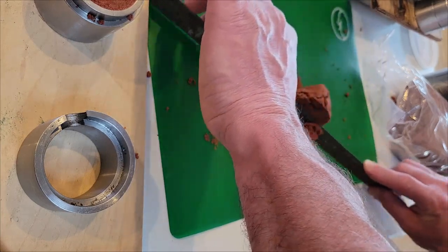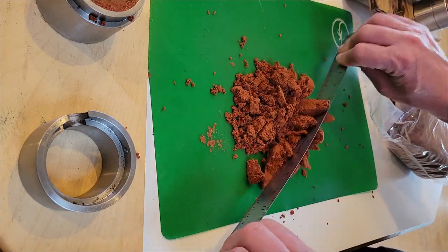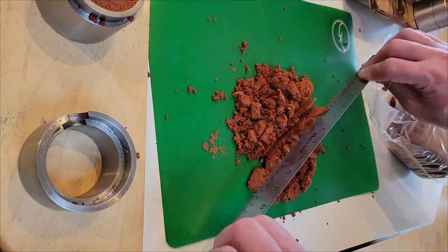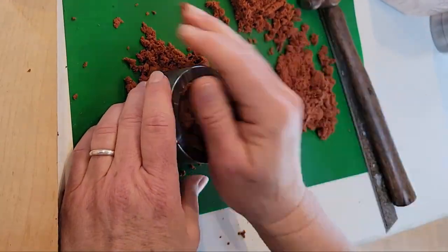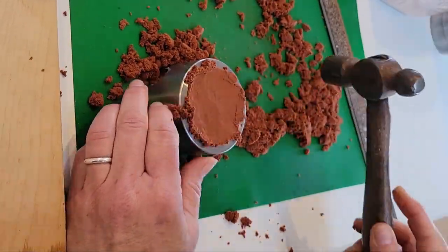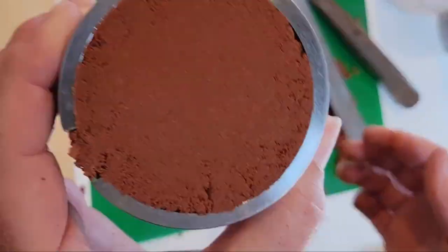My oh my, Karen, what impressively large hands you have. Steve jumped in for the collaboration to mash up the next batch of clay. We repeat the packing and perfecting of the other side of the cylinder, same as the first, for the second side of the casting mold.